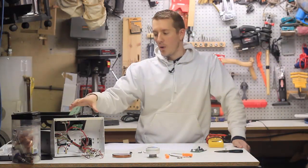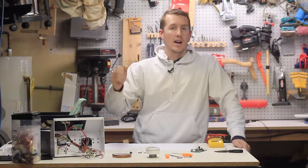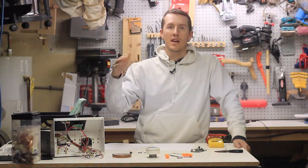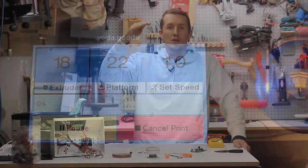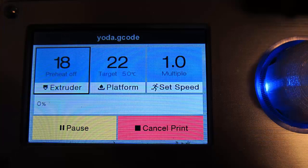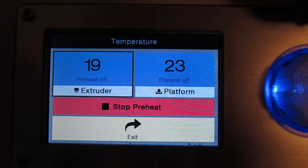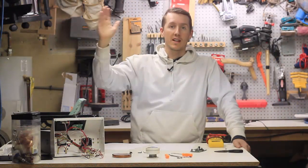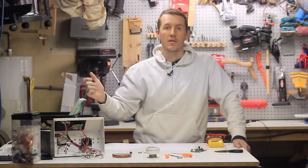But I thought I fixed the problem, and I didn't - there was another one. When I took it upstairs and turned it on, I thought everything was fine. Then I went to the temperature settings and I noticed that the hot end temperature was going up and up and up, even though the target was zero. The temperature kept rising and it was going way up. Once it got to 200 Celsius, I shut it off.